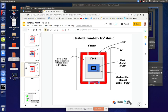Now, also these parts here that have to go right up to the rods, I would actually use sheets of polycarbonate there, with wood or something, because I think we want to maybe have that openable readily, like say we have to put another heater down there or something. Something that you can take off and actually open up the inside of that chamber, because that little part in between the rods is just a vertical, so how are you going to attach it? So I was thinking of doing something like polycarbonate on the front of the box, and that pretty much closes it, but it can't be all the way because you have to allow for some connection at the top. It has to be like an H shape to allow for the rods to go up in between. You have to have some kind of connection at the top and bottom.